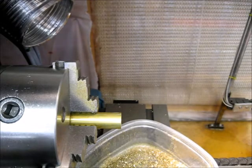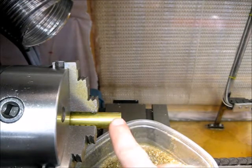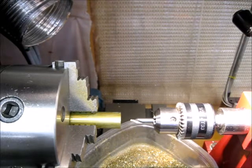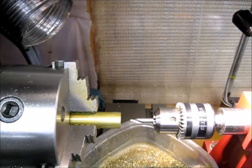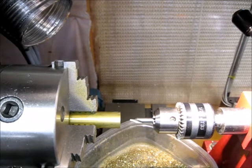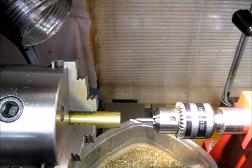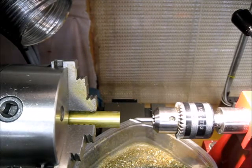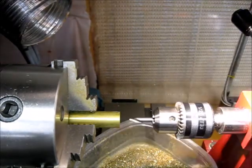I've got a new piece of stock loaded up — three-quarter inch brass. First I'm going to drill out the centers: center drill, bigger drill, and then a W drill, because that's the closest thing I have to 9.8 millimeters, which if all goes well this should just slide right inside of.